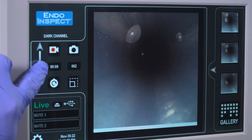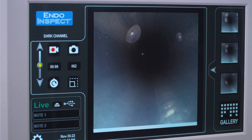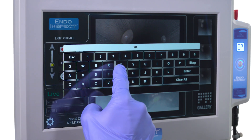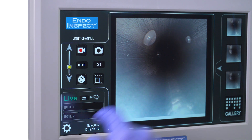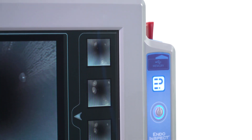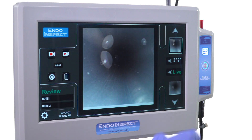To adjust brightness, touch and hold to slide this button up or down to tailor the system's automatic brightness response based on particular device inspection requirements. To add notes, users can tap either of these two note fields to bring up an on-screen touch keyboard. Notes typed into these fields will become part of the corresponding saved image and video files. They will also be visible when any image or video is reviewed on the monitor screen. The main center area of the screen is where the live image is displayed. The right side of the screen area displays the user's 3 most recent image or video captures. Users can touch any file to review. The saved image or video will then display in its own window. Users can return to the live image screen by touching the live button.